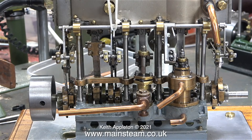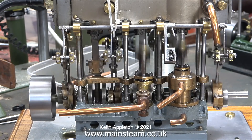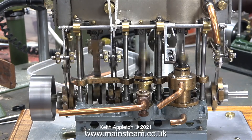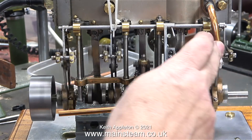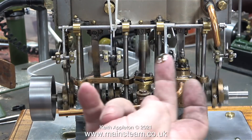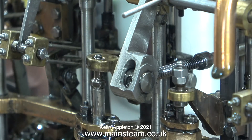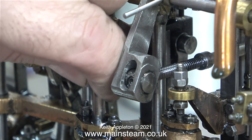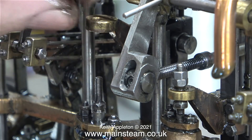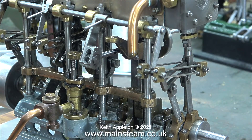To support the intermediate cylinder's expansion link, I used some tie wraps linked together, and as you can see it's made all the difference — the engine is easier to start and it runs much better. The oil residue from the cylinders is about the right colour so things are looking up. I'm going to disconnect the water pump and the vacuum pump so I can hear what the engine sounds like, because the vacuum pump makes quite a loud noise. Listen to the difference when I run it this time.